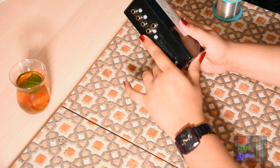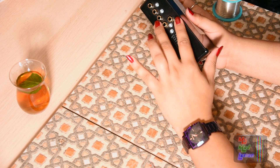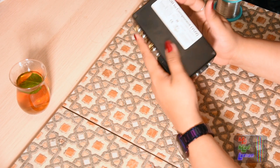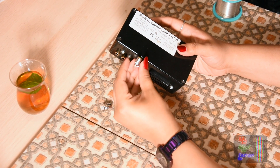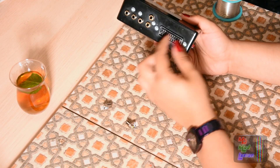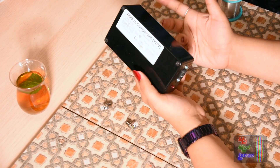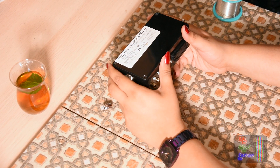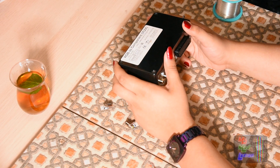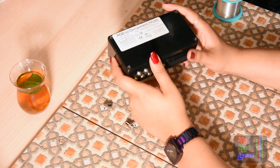What I'm going to do here is use this box and mod it. I want to add a breakout on this box — I wish to put an S-Video and also composite outputs on this, getting them directly from the SCART here with decent wires, so I can at least have a decent breakout cable with this. That's the only problem with having a BVM — you have to have breakout cables and it's really annoying. So this is my solution for it.